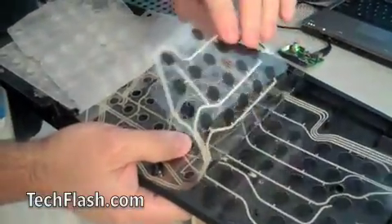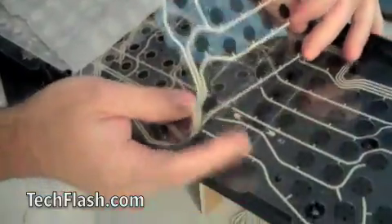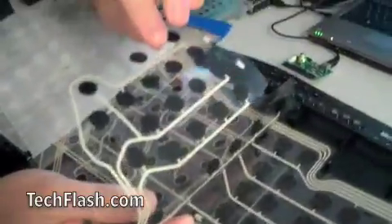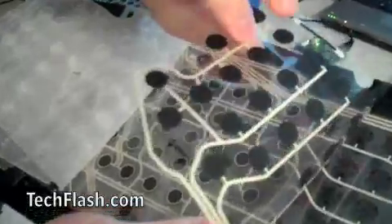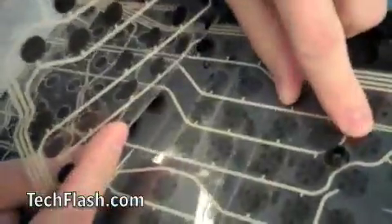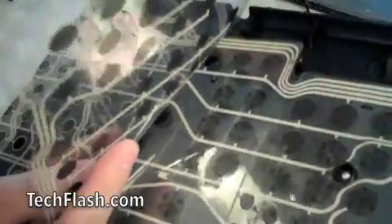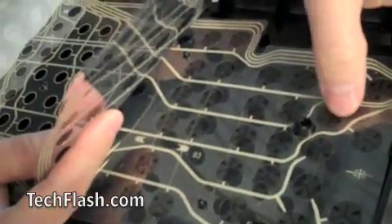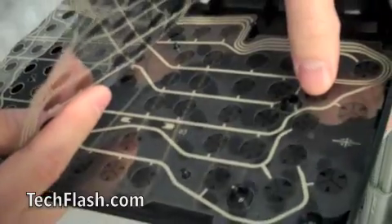What's different is that instead of just being printed with silver ink, this is screen printed — like making t-shirts — with carbon ink, which is resistive. When the top piece of carbon comes down and hits the bottom one, initially that little nub hits right in the center and just touches there. As you press harder, it conforms into the hole and makes more and more contact along there. It's almost like a wiper on a potentiometer — you're decreasing the resistance as you physically connect more and more of that length, so you shorten that resistor.